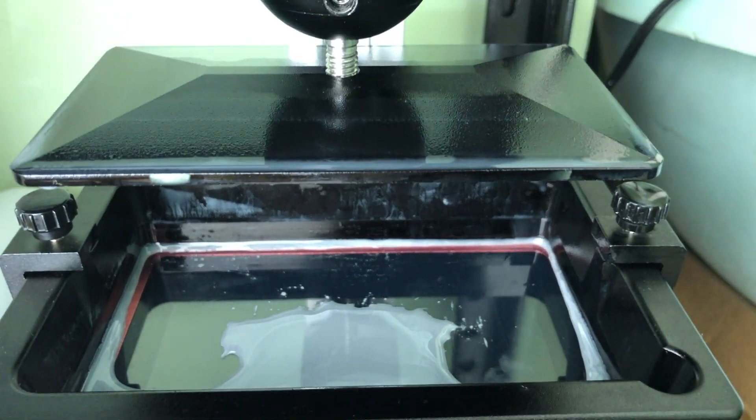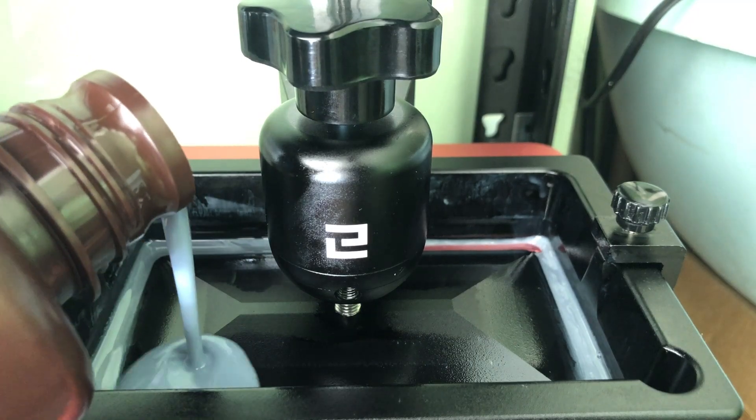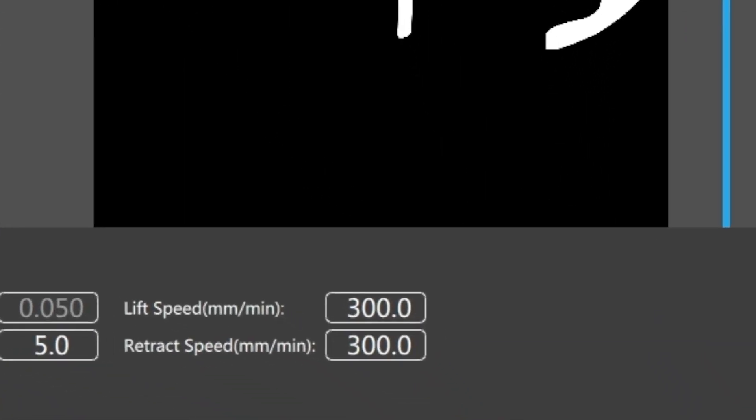What you need to do is home the build plate into the vat and then pour your resin just to the level that you would like, so that way you're always sure when the build plate comes down into the resin it doesn't go into the screws and all of the other mechanisms that help level your build plate. This is especially important for you guys who like to print very quickly and have really fast retract speeds. So this leads me right into tip number two.